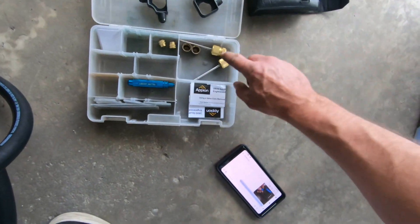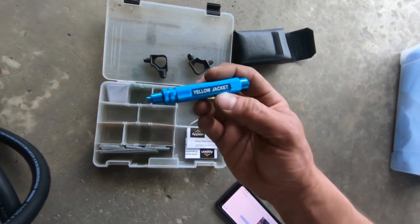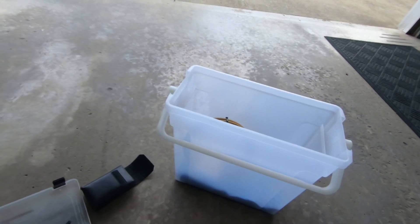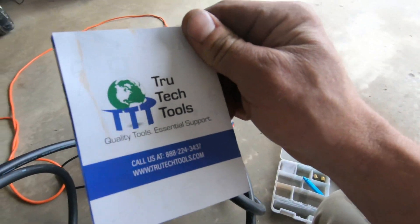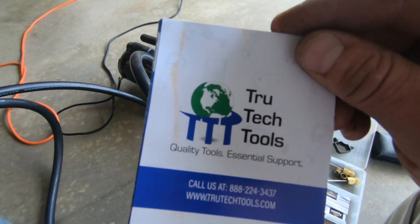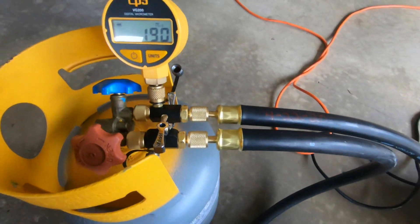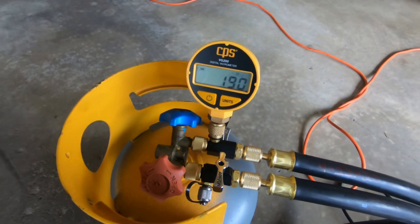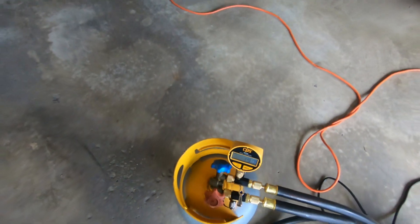Here are the other parts that go to the core remover tool — my caps. I've got this Yellow Jacket gasket remover tool and I threw everything in it. I found that in a dumpster and it works out perfect for rolling the hoses. I got everything from True Tech Tools — check them out, I'm about an hour away from where they are, good people. Both core remover tools are closed so I'm isolated to the tank, and I actually dropped 10 or 20 microns and I'm holding at 190. Short video coming from my garage.